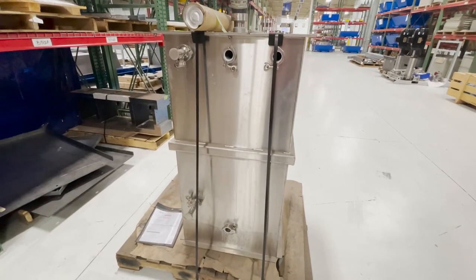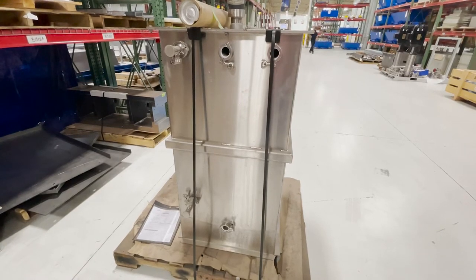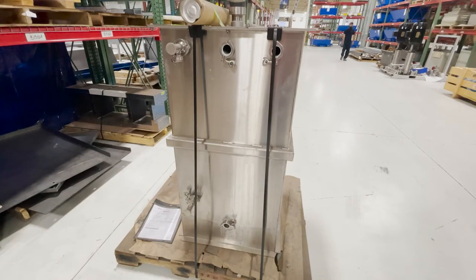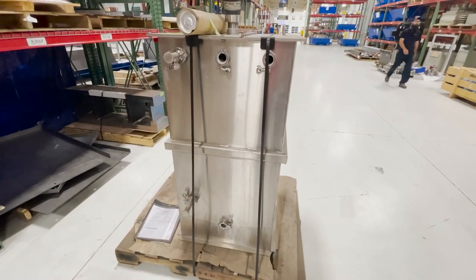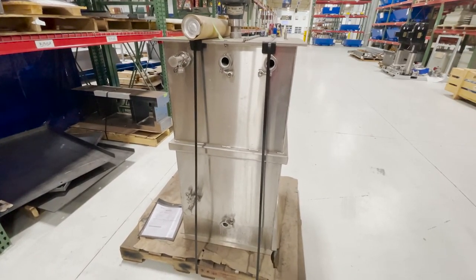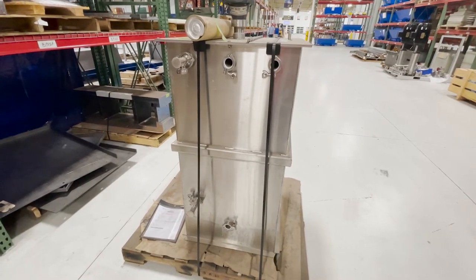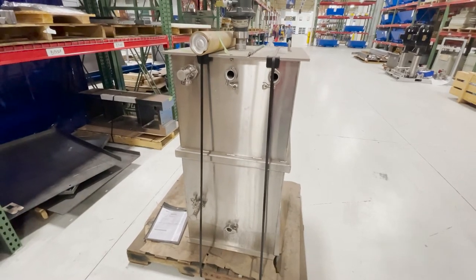With the lower valves closed, we're flooding the chamber. In the process of a 15 to 20 minute circulation, we lay an even coating of filter aid on the face of the filter cloth, and that happens every time you run the press. That's why you have the mixer — so your solvent and filter aid stays in suspension. We keep it suspended so it goes into the press and coats the filter cloth evenly.